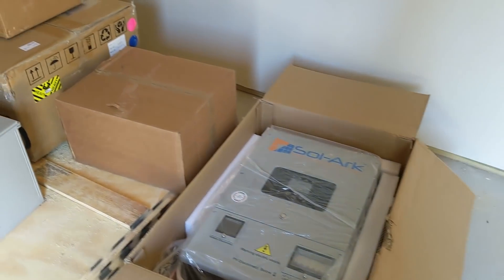We're looking forward to getting this going. It's going to require a larger bypass — 200-amp gear on this one: combiner panel, 200-amp transfer switches. This is the first day on the job, just getting going, so there'll be many parts to this.